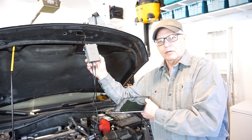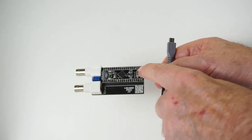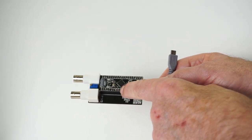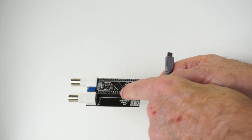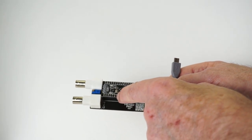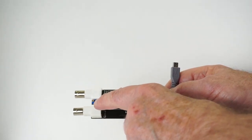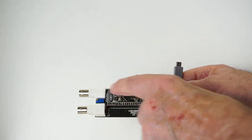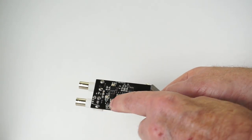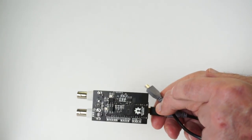Let's head out to the studio for a brief overview of what's in here. We started by building a standard USB version of the HS402, just like it was done in Gadgets number 118, so I won't dwell on it. It's an option one build, so we have a one kilohm variable resistor we can adjust while in USB mode, along with two variable capacitors we can trim as well.